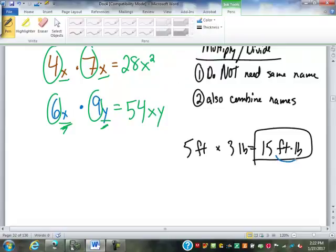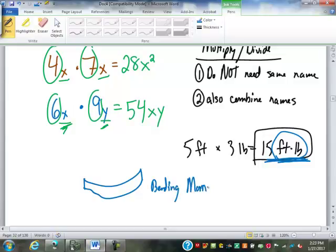In construction, by the way, foot pounds is a very important unit. When you start talking about analyzing beams, the bending in a beam is calculated in foot-pounds. It's called bending moment. And if you look at like I-joists or anything like that that you're going to order and use, they will be listed. They'll have a maximum bending moment. So at some point, you'll look at figuring out what is that bending moment that's generated on a load sitting on those beams or joists.